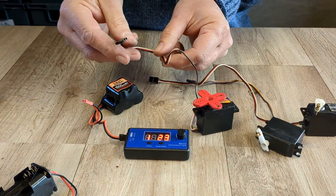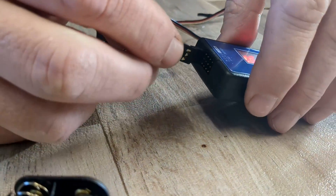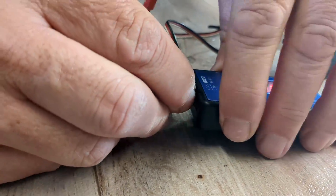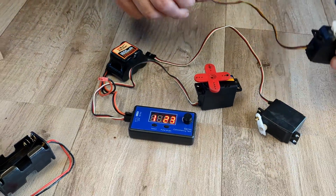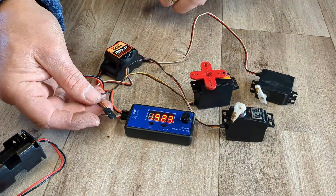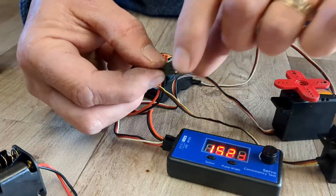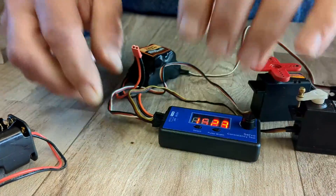It's not anchored properly but it gives you an idea of what's happening. So again, the negative wire goes to the bottom and we're going to connect it — I can connect in any one of the ports. We'll do the same for this one, and again I just put an arm on top and I connect it negative wire down. Negative can be black or in some servos it can be brown, and I'll connect that into one of the other ports.